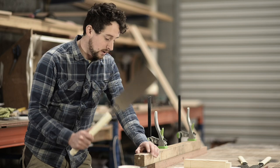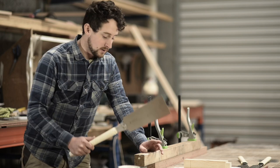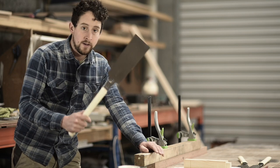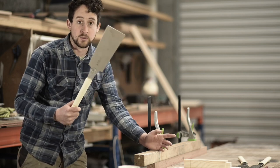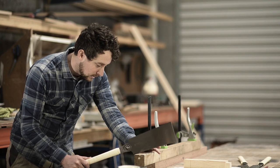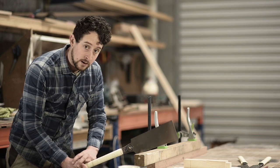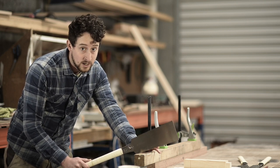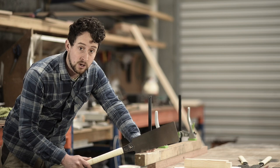When doing a cross cut with one of these Japanese saws — the Ryoba or any of the others — you actually want to start with the handle down, rather than handle up like you would with a Western saw. When you've got the handle down, you're pulling those teeth into the grain, which helps with the straightness of the cut by providing that tension. You want to do long straight cuts, hold the saw as far from the blade as you can, one hand or two — whatever you feel most comfortable with. I usually start with one hand to guide the blade, then change to two.